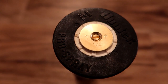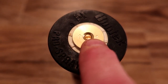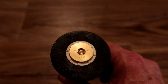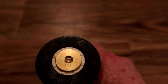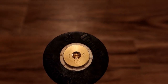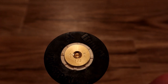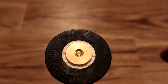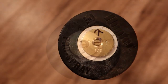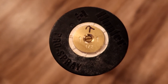This is what the head looks like from the top, and it's important to discuss this. There's a little half-mark and arrows — that arrow tells which direction the head will spray. So obviously if you want the head to spray a certain way, you need the arrows pointed that way. You might also need to adjust the amount of flow coming out of the head using the little screw in the middle, which allows more or less water out depending on your needs. Since it's a little dark out and I don't have my glasses, I drew a little arrow on there with a Sharpie so I know which direction to point the head.